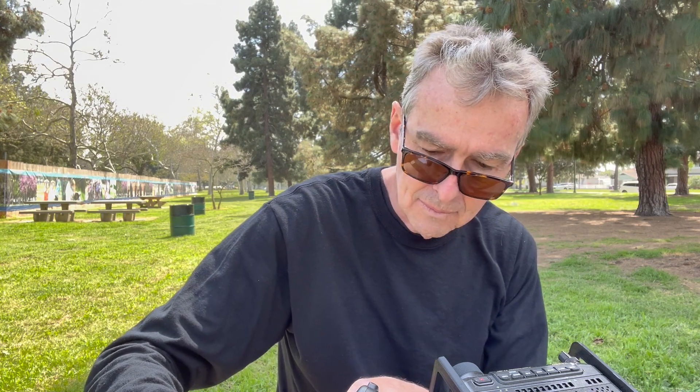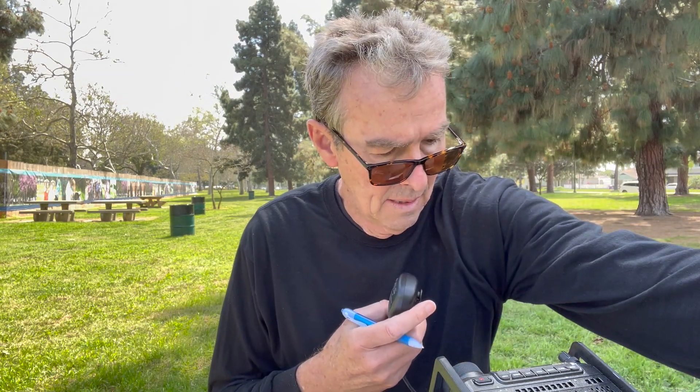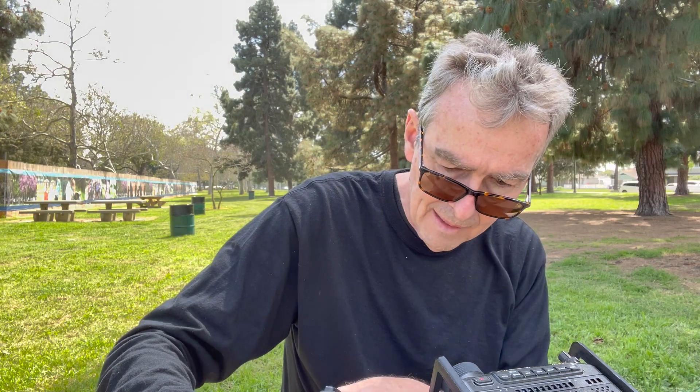Very good — Long Beach, California, a really good signal. You did fall out a little bit — QSB got you — but I think we can make it work. My name is John, and I'm located in the central part of North Carolina. Hey John, if you don't mind, I've got two exact same antennas — 10-Tennas end-fed half-wave antennas — but I've got them pointing 90 degrees different angles, and I've got a switch here. I'm trying to determine the directionality, whether one's better than the other. I'm going to flip over and see if you notice a difference. Do you mind?